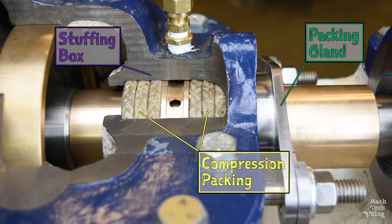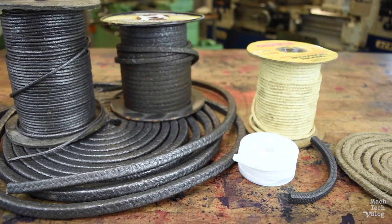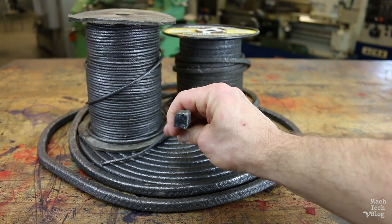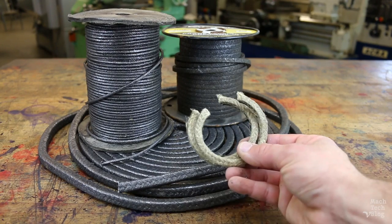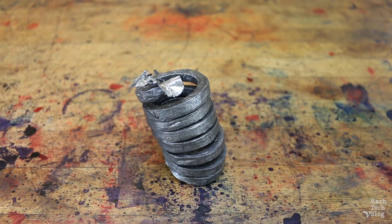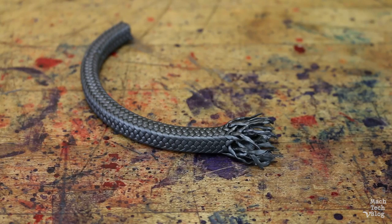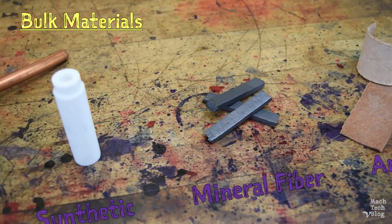As we can see in our example pump, this basic sealing mechanism has remained relatively unchanged for millennia. However, there have been some improvements in packing construction and materials. The compression packing available today typically has a square cross section and is sold in standard sizes as individual pre-cut rings or in bulk quantities in large coils. There are multiple types of construction, including metal foil packing for applications where other types would be too soft and would tend to extrude out of the stuffing box. But the dominant type has a braided fabric construction. Material options range from plant fibers, animal fibers, and mineral fibers, to synthetic plastics and even metals.